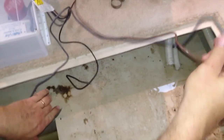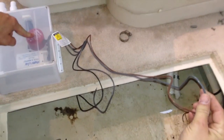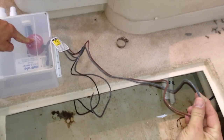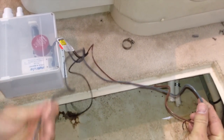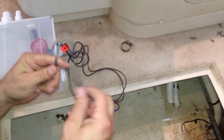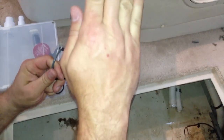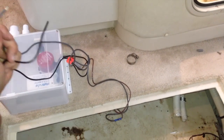If you look back over here, you can see we have a loop. What this does is it loops through a circuit from probably the positive side of the bilge pump to one of the sides of the float switch. The other gray wire is the other side of the float switch. So you're creating a circuit — whenever that float switch comes up and closes the circuit, it flows through and turns on the bilge pump.